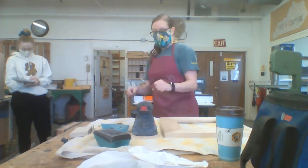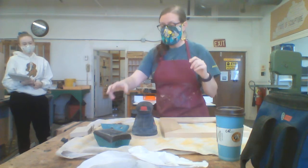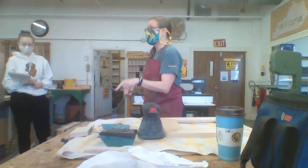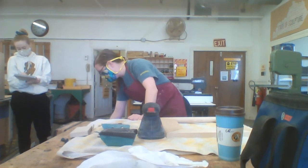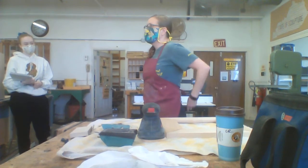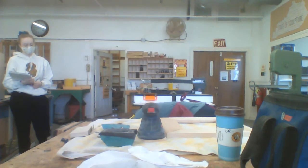This is going to generate a ton of sawdust. You can take the filter off the back end and hook it up to this vacuum cleaner — only this one, the orange Fein, F-E-I-N. It's got this really awesome plug on the front end. What it does is you can plug your sander directly into the vacuum cleaner, then set it on automatic instead of manual. When you turn on your sander, it'll automatically turn on the vacuum.